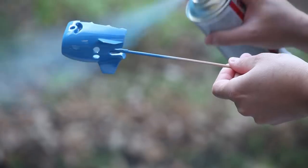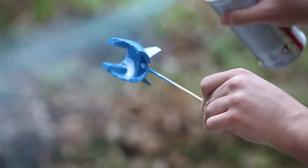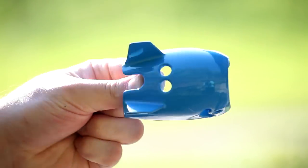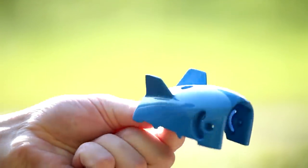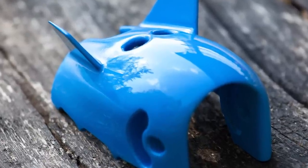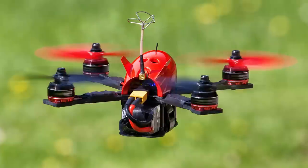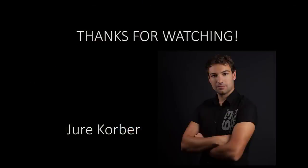Wait at least 24 hours before touching the finished part. Even if the paint may look dry, it can still be soft inside and you will leave fingerprints all over the piece. We now have a professionally looking product that looks like it was made with injection molding. Imagine how cool your next 3D printed part may look using this technique. Paint also adds some chemical resistance and some extra strength to the piece. Thank you for watching this tutorial and I hope you like my finishing technique. Please leave any questions or feedback in the comment section below.